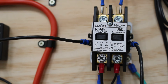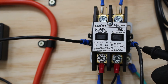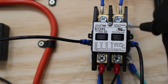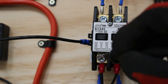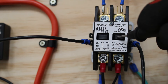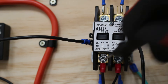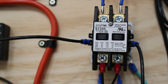The way this works is similar to a relay — same concepts in general. Once the coil is energized, in this case we have a 24-volt coil, once we have 24 volts across the coil, we will create a magnetic field and you will see the plunger close — it will pop in. That means we are sending voltage from one side to the other on each pole. These two across from each other are isolated. Once energized, it closes and creates contact from top to bottom on each pole individually. Keep in mind, this side is isolated from the other side. I'll now show you a demonstration.